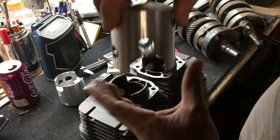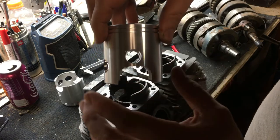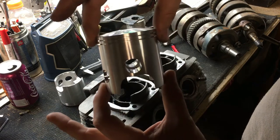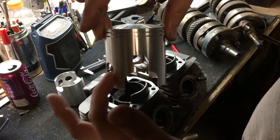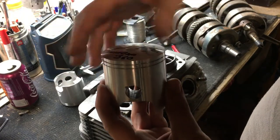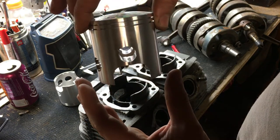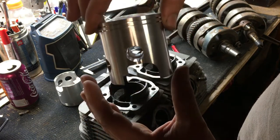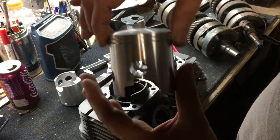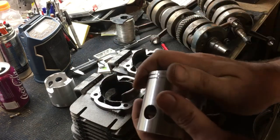The ring area is really the focus of the power — that's where your compression comes from. The secondary contact is the skirt touching the cylinder wall, which keeps the piston square in the bore. If this was worn out or over-bored, the rings will still expand into the bore giving compression, but as the crank comes up the piston will tip back and forth — tick, tick, tick.